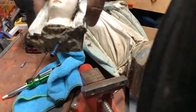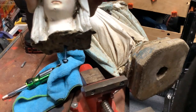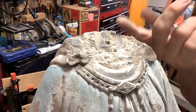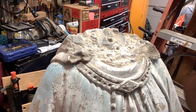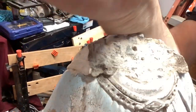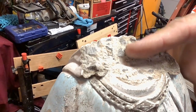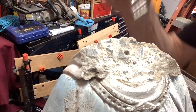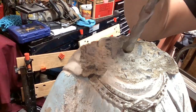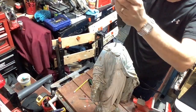Now we need to drill the corresponding hole of a larger diameter into the body - that's going to be the next endeavor. Shooting this while drilling was a little tough, but here you can see the hole. I indexed it using a zip tie that I cut just to see if it lined up, and it seems like it lines up. Now I'm going to attempt to go into it with the larger bit - hopefully all goes well.